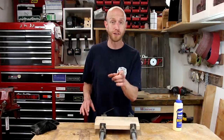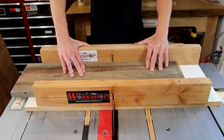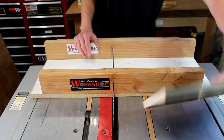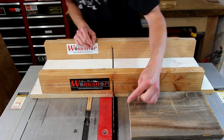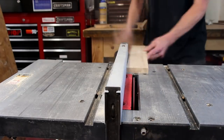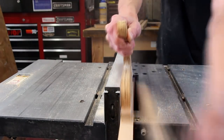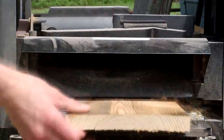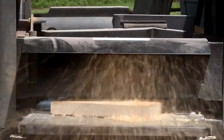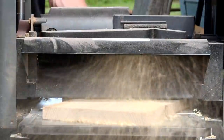I'll set that glued piece aside to dry while I work on the rest. First I'll cut the barn board down to length — nothing like a nice sharp brand new blade. Then I'll rip down some strips of white oak that'll trim out the barn board. To flatten the back of the barn wood I'll run it through my thickness planer on the back side only, and I'll plane down the glued-up piece to thickness as well.